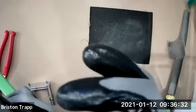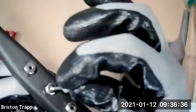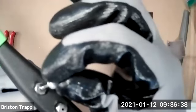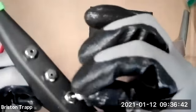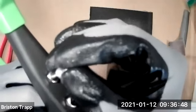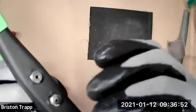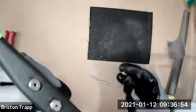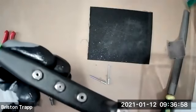There should be one that's even smaller, but definitely doesn't fit. One that fits nice and smooth, and then one that's actually a little bit too big. So you wanna find the nose piece that fits in with barely just a little bit of wiggle room. Definitely not the one that's too big. They're not marked, they're not labeled, and that's a 7/32 diameter.